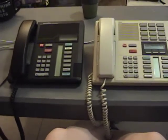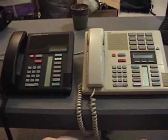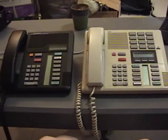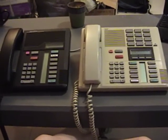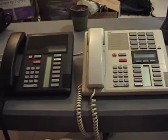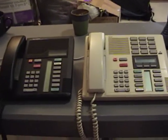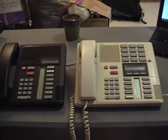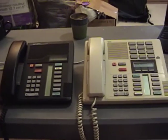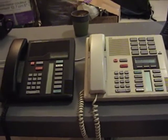Office telephone systems are usually centered around a device called a PBX, which stands for Private Branch Exchange. That raises the question: what is an exchange? To answer that I need to describe the actual POTS telephone system itself. POTS stands for Plain Old Telephone System — the landlines running into your house. There's also the term PSTN, which means Public Switched Telephone Network, which is a nicer technical term, though I'm not going to change my terminology now.